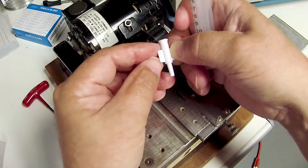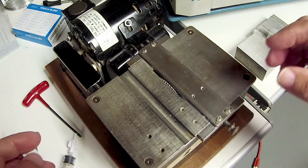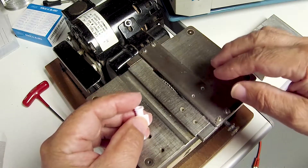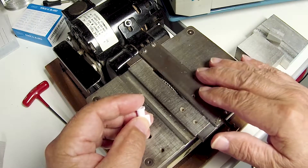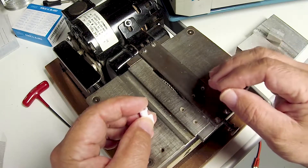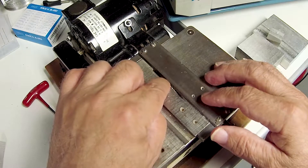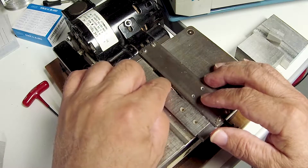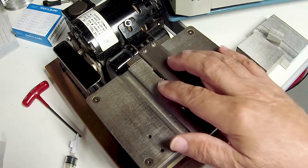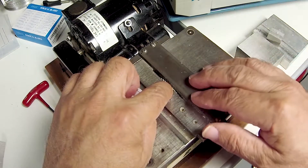Without this little groove it would be almost impossible to do so. I decided to develop a system where I could buy these unmodified tips and then modify them to be used on Epson type printers. I'm going to show you how I adapted my miniature table saw — which I use a lot to make my scale miniatures as well as for cutting precisely scale pieces of wood and metal. I am using machining blades, specifically the type used for slitting or slot cutting, called screw slot cutting blades or slitting blades, which provides me with the level of accuracy I need.